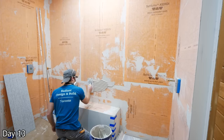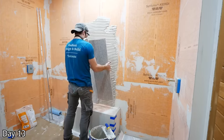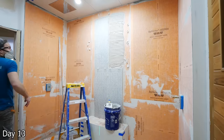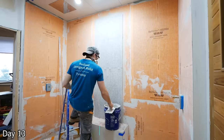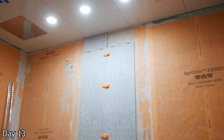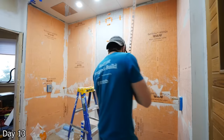Originally, the plan was just to have the same tile on this entire back wall, but I thought it was going to be a bit bland — just an entire white wall. So I spoke with the homeowners and they decided to put the same tile that was on the vanity wall as a little accent strip going up this back wall. I thought that was incredible — I wasn't sure how it would look at first, but after seeing it come together, man, I just thought it was really beautiful. It's simple of course — we got the white and light gray, which is very typical, but it worked out really nicely. I was really happy with their design choices on this entire project. And then sliding in a couple of 3/8 inch thick chrome profiles on the edge so we can have a transition between the two tiles.